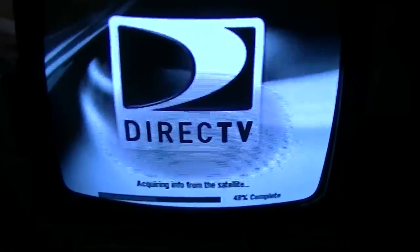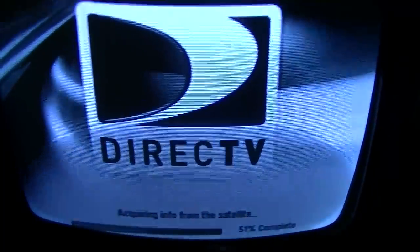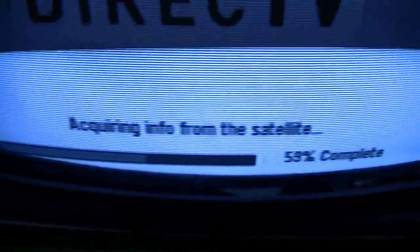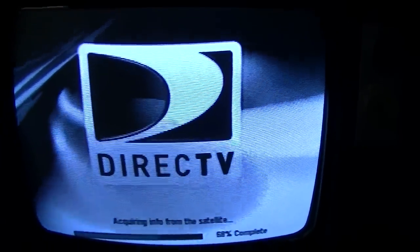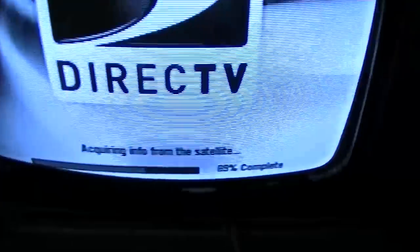Super bright and super sharp. That little strobing there, that's some sync issue with the camera. Super bright and super sharp. Didn't do anything to it except solder that resistor and that wire that pulled out of the socket, because when they dropped it, the CRT rocked back and the neck tilted up and pulled the wire and resistor out of the socket.